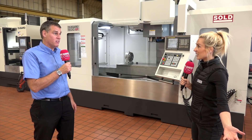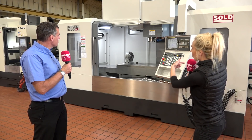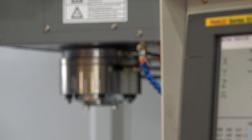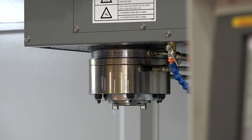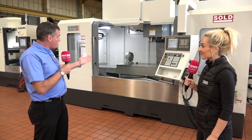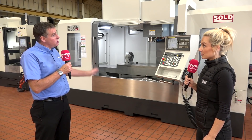So a control to suit everybody really. Exactly that. And you've got the option to have a fourth axis. But let's talk about that spindle — you're machining big heavy parts, have you got the power in there? We have. That's again part of the Extra Performance — it gives you a bigger rating on the spindle. It is a 40 taper, but with modern tooling technology it's not about big depths of cut these days; it's all about smaller depths but going faster. Because this machine can do 33 meters a minute rapid traverse, we're not compromising on your cycle times.